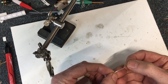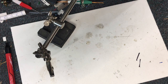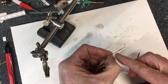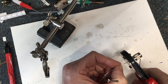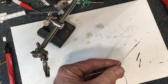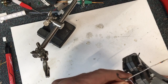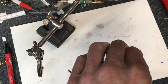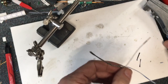I usually look through a magnifier — I can't see well enough anymore, the stuff is so small. I got the pin on there and you can see there is wire exposed here, which is not typically what you want, but in this case I'm going to crimp that pin on just like you would normally. That leaves me exposed conductor, which you don't want, but now I'm going to put it in about the middle — it's going to go about where I want just by bottoming out.